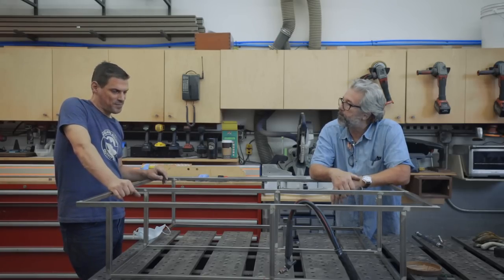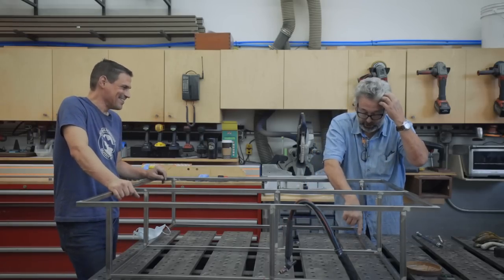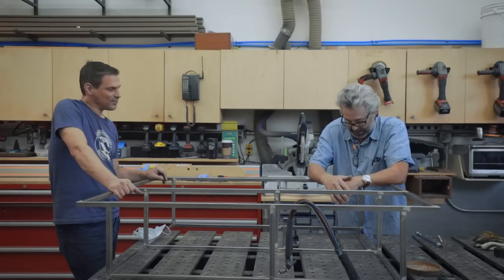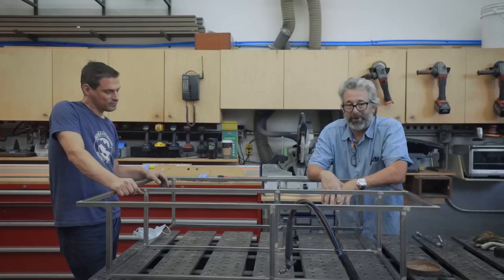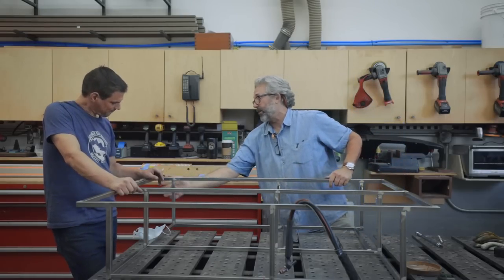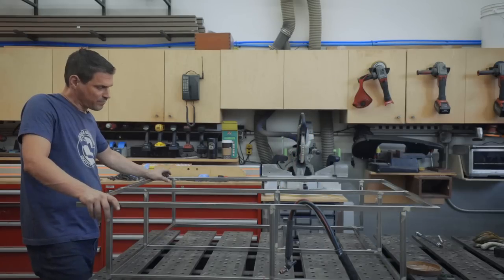Right on. One thing I want to mention again, because people have reached out and asked about the plans: we were changing the plans even today. A good example is we were originally not going to put these where they were, but to make the feet of the cooler sit on something and not just rely on these, these had to be in a different spot, so we had to move those. Right, and now the refrigerator sits right on those cross pieces. So that's great. And so the plans we put out will be what we ended up really doing. We'll just modify the CAD files for the little teeny changes, and it's really not much. We decided you didn't need a brace here. This is way strong enough, so there's no sense in adding any more material, so I'll take the brace out of the plans.